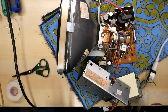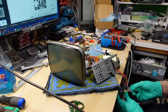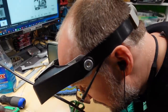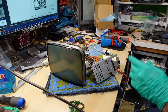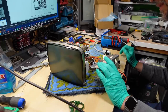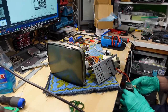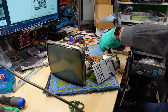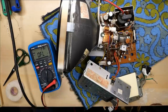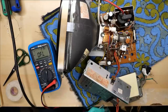Let's see what happens. Just making sure, one final check, make sure everything is not touching. We're good to go. Here we go — power up. I don't really hear anything. Definitely not hearing any activity whatsoever on this thing. So it seems like there might be a power supply issue. I should measure the voltage coming in from the power supply. Actually, first I should just check to see if this power switch is working, in case it doesn't have continuity. So we'll remove the mains input. Okay, we have continuity there. That's good.